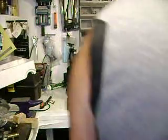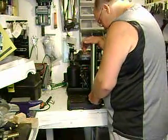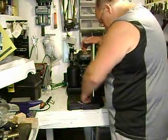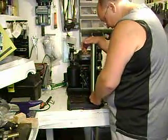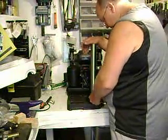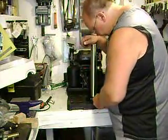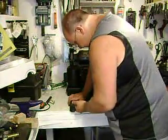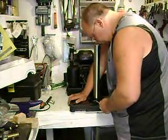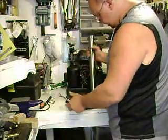I'm going to take a lucky guess here. Should have been a 12. Yeah, that's 12. So, now when you're putting a drill press together, you want these bolts tight, but you don't want to do much more than flatten that lock washer, and just a bit of an extra snug. That's pretty tight.